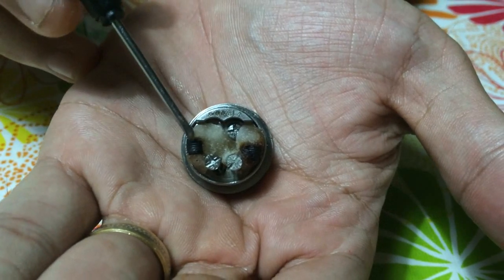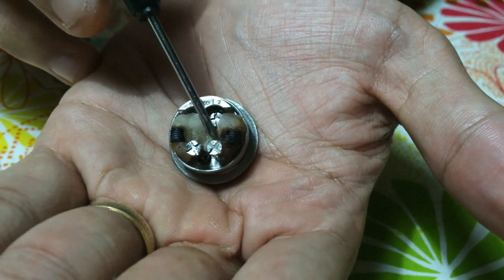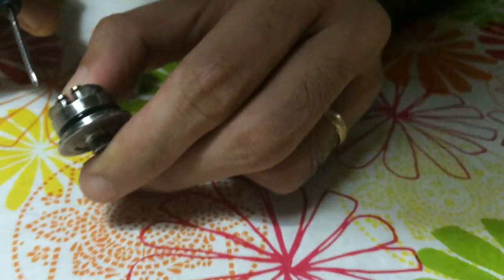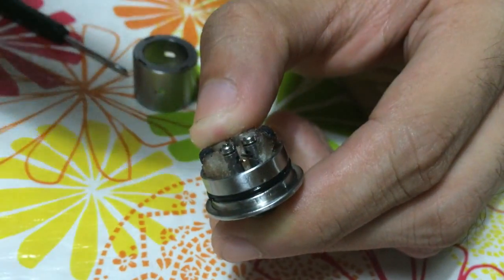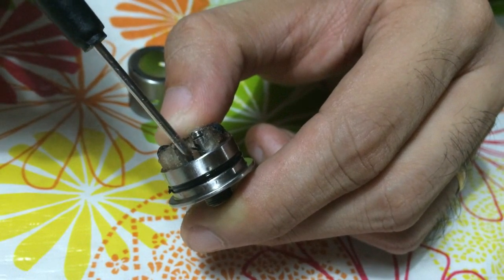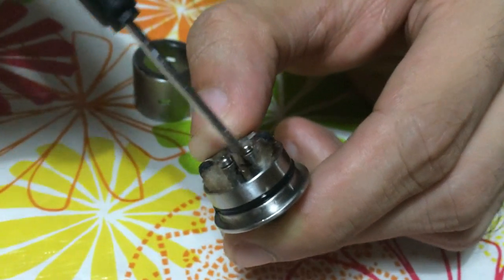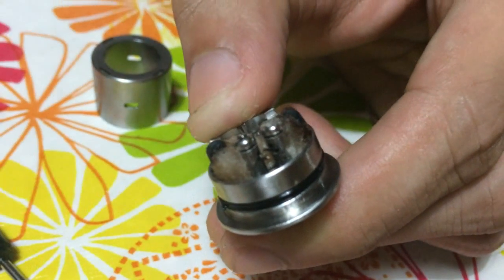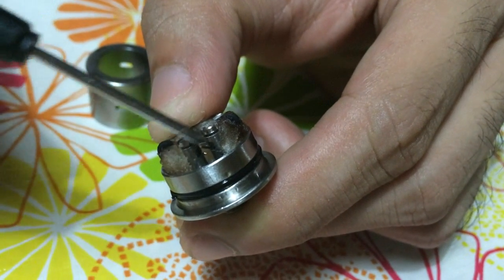Your leads shoot in — one lead of each build will shoot into either one of these poles, which, if you'll notice, is angled. They're facing opposite directions that intersect diagonally. You can see one of my leads sticking out there, the other lead sticking out right over there. Why are the poles oriented like that? No, it's not a factory defect. They were oriented like that so that when you stick your leads in, it doesn't go out through the other pole, making it a real bitch to clip. That's the reason why they oriented it in that manner.